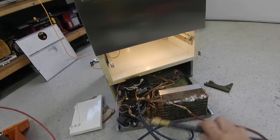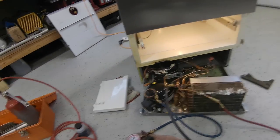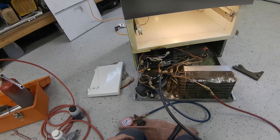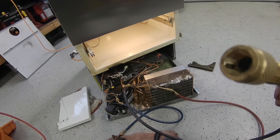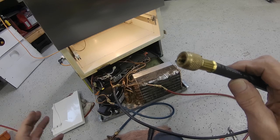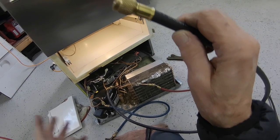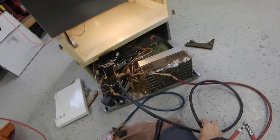The compressor's running. I can hear it sucking any nitrogen or air out of the system. Once that stops, you leave it in a vacuum. You purge your Freon tank or charging column — whatever you use — and run some refrigerant through the system before you remove the hose, just to make sure you've gotten all the air out of the system. And that's how you do a sweep charge.